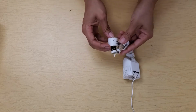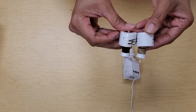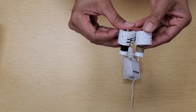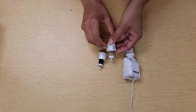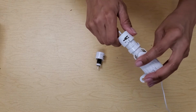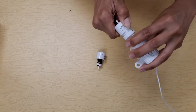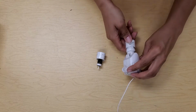You're looking at 2 corks, one old and one new. You can see the difference between a fresh cork and an old cork. This old cork is moldy and the discs are smaller. They might not swell enough to press on the switch that interrupts the electrical circuit to prevent irrigation. This moldy cork needs to be replaced.